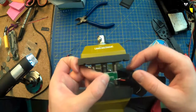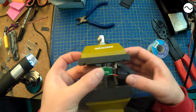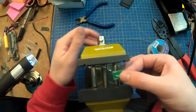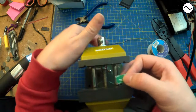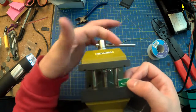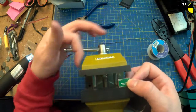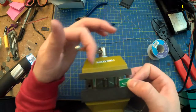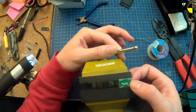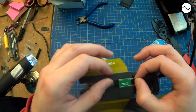Do I still have it? Didn't it only fail? Oh no, that was the thing: the one that failed when the power failed was using a crap gasket. I laser cut the equivalent of the box out of acrylic, and then I made this crap vacuum gasket out of mastic, like kitchen, bathroom kind of sealant stuff, just to prove the concept. As long as you had the vacuum pump on, it held on, and as soon as the vacuum pump went off, it squidged out and let go. But using an actual decent gasket, it worked pretty well.